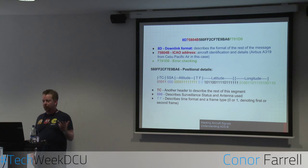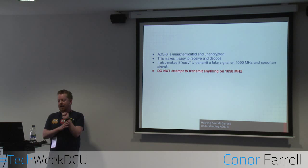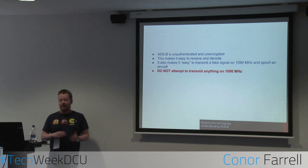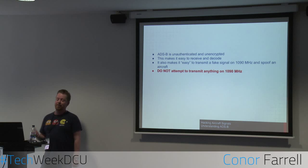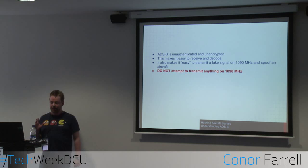Now, I mentioned already that it's unauthenticated and unencrypted. Literally all an aircraft does is broadcast over and over and over again. There are no requests sent by air traffic control or anything. This was brought to the attention of the FAA recently, probably within the last couple of years anyway, and they don't seem to be too worried about this. I don't know if it's been a problem so far. They're quite happy that with radar coupled with this, they're not going to run into any problems. But as you can see, if you have a transmitter that will broadcast on 1090 megahertz and you can make a spoof signal, you can spoof an aircraft. And it's very dangerous too. It's hugely irresponsible. I'm not going to do it now.